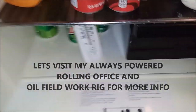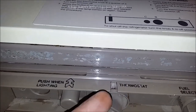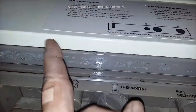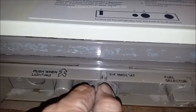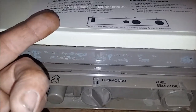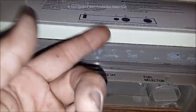Coming in here to this refrigerator — this one is currently set for summertime, so it's on a lower setting. Winter is coming on, so I've marked the dial positions with liquid paper. You can see a little corrosion from years of use — this is quite an old unit. That mark is the wintertime setting and this is the summer position. I'm going to set it between the two now since it's fall. In the wintertime it draws in colder air and requires more heat to create the absorption effect.